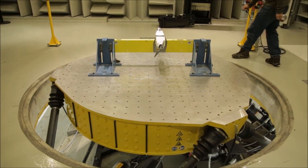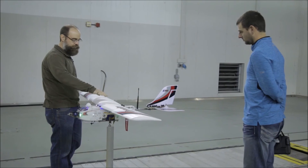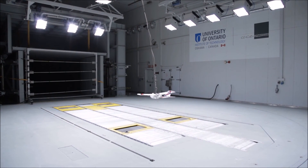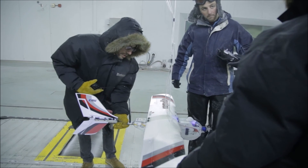I'm busy testing. I can honestly say this is an engineer's dream. Some of the most difficult parts of engineering systems like this is trying to recreate the environment that we're operating within. We can do lots of calculations and design materials with certain material properties, but ultimately it all has to come together into one product that just has to perform. All under one roof here, we have the ability to fly our aircraft at cruise speed — both in a static situation and in the free stream. Just behind us we have a multi-axis load table where we can impart aerodynamic loads and landing loads on the aircraft, and we can do all of this at temperatures ranging from minus 10 degrees Celsius up to plus 40 — and we can go beyond that. We can truly stress this aircraft to the max. Even since we've been here, we have found small changes that have already saved our company tens of thousands of dollars, just in the data that we've collected to this point.